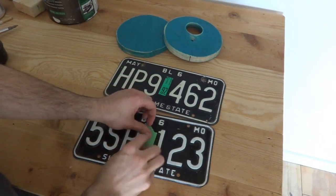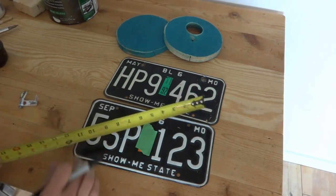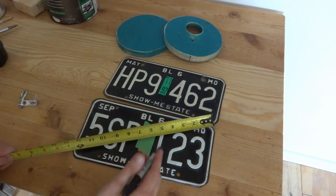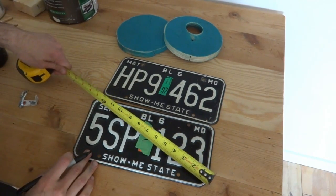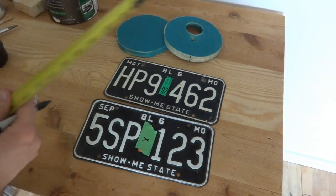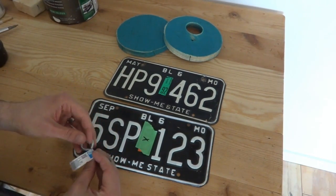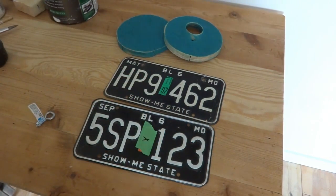And it's a 1/4 inch, so I'm just going to use a 1/4 inch bit to drill through center. Now to find center, it's very similar to how I did it earlier. I'll just use a straight edge from corner to corner, and it looks like it's about roughly 13 inches, so we'll call it a little line there. I'm doing this way as well, and it looks like that's probably pretty much center. So I'll drill a hole in there real quick, and then before I pop this in, we need to actually kind of mold these to get them ready to mount to the wood.